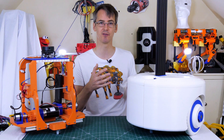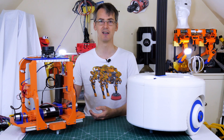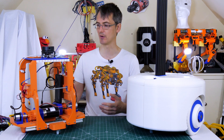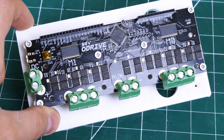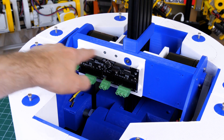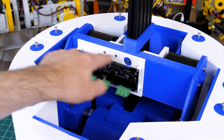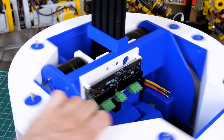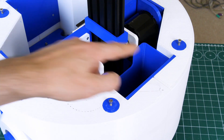In my previous ROS robot I had motor encoders on the wrong end of the motor and some hacky code to regulate speed, then recalculated velocity from that. With brushless motors this opens up more possibilities. It's an oDrive 3.6, 56-volt version — we'll just run on 24 volts, which gives more than enough power and controls two brushless motors with encoders. It fits right on here — I left screw holes in this beam for mounting. The motor power wires come out each side to the green connectors and the encoders are on the back, easily accessible to plug into the oDrive.